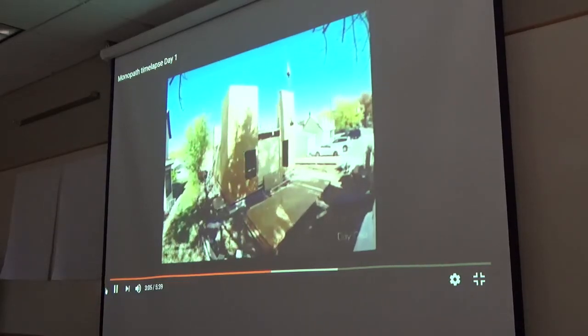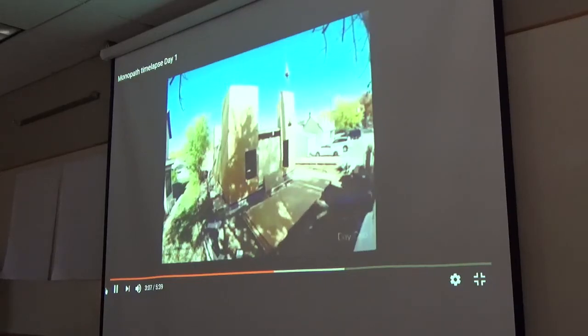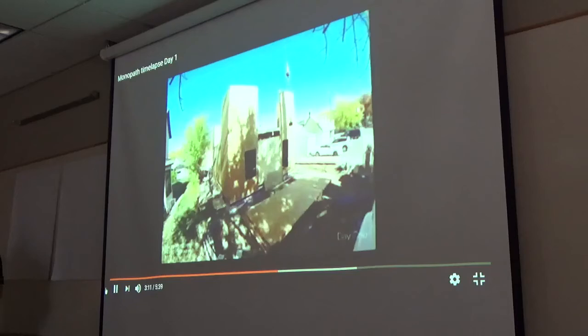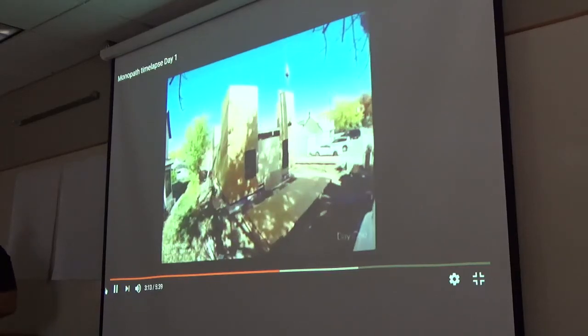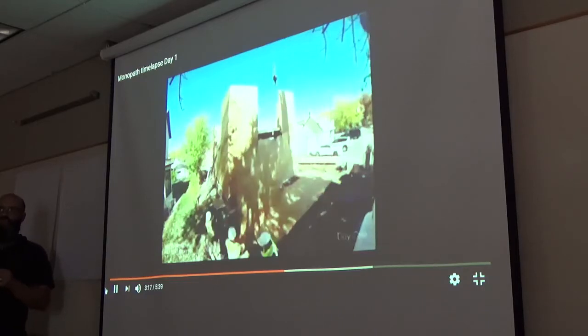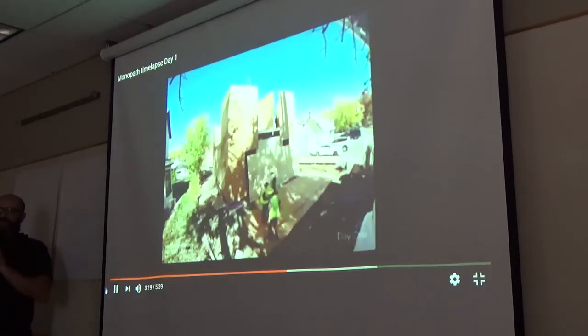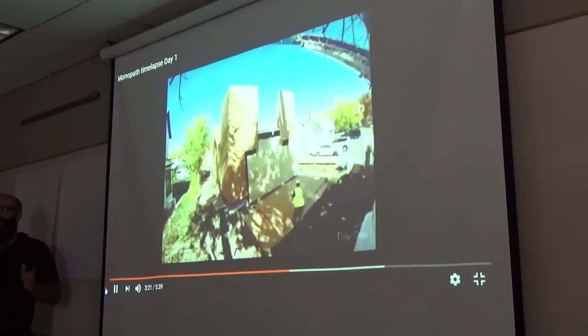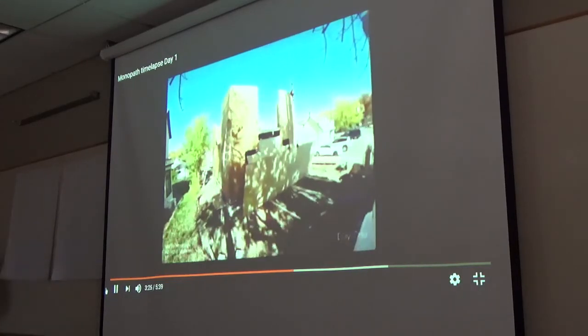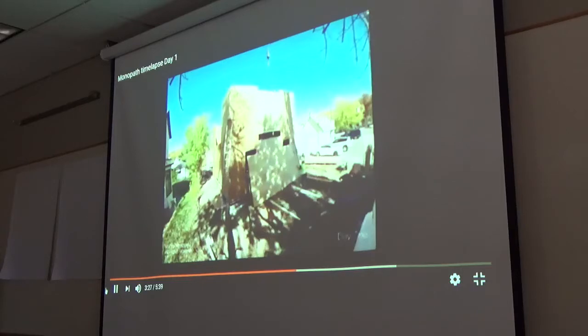And then to back up just a little bit, on the subfloor on the first floor, you align the edge of the panels to one side. Ideally they should be lined up, right? The other side, they're a little bit long. You just cut them off before the other exterior panel comes in. Yeah, they'll be 2 1/4 inches long. Got it. The width of the 2-panel exterior wall.